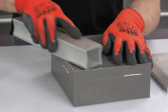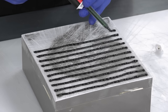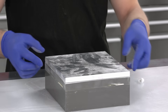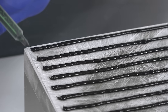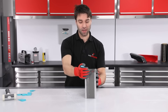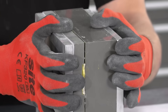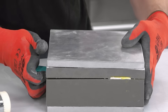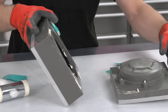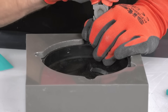To prepare these for bonding I'm just going to flat out the surfaces, key them, and then bond them using VM100. In this application you could probably use almost any structural adhesive, but I'm going to use the VM100 because it does a particularly good job of bonding epoxies to aluminium. With these now bonded, we can separate the mould halves. To remove the part, the perimeter is first loosened with wedges — this initiates the release and makes pulling the part much easier.